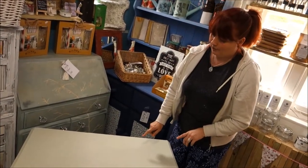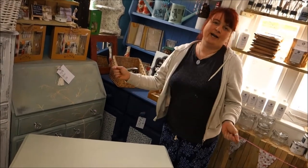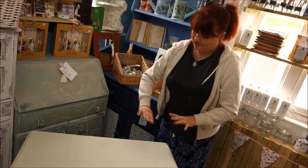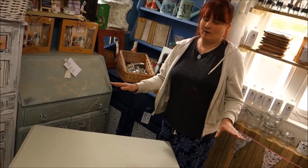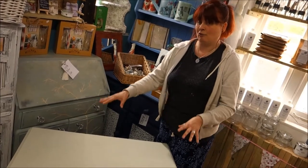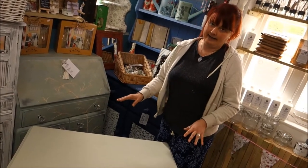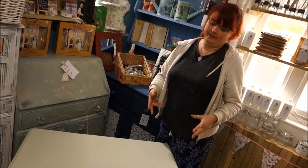Second point: if you decided to abandon the light colour and paint it dark grey or black, that will cover it but it won't solve the problem. If you then thought you'd paint white over the top, the bleed would show again because it's not blocking it, it's just blinding it. Third point: whatever you do, don't finishing coat it at the end, because finishing coat is likely to draw it all back out again. We've blocked it and painted it, so now I'll absolutely be waxing it on top to protect it and will not be using finishing coat.